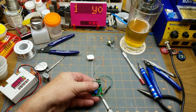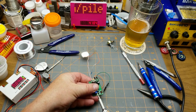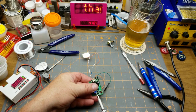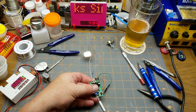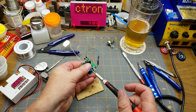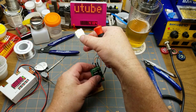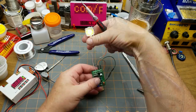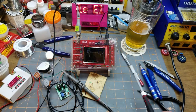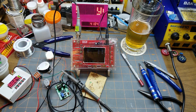Let's do some adjusting of this potentiometer — we should see that thing start ramping up. I can see it getting brighter, and I can also see the current going up on the power supply. We're at 40 milliamps right now. I think you guys can see it getting brighter. One downside of using the multi-turn pot is that you reef on it for a long time to get to the end. That's getting close to max brightness — 60, 62, 63 milliamps. Then of course we can spin it back down.